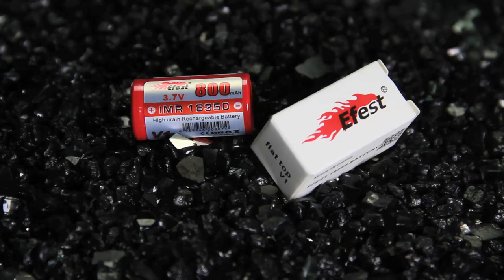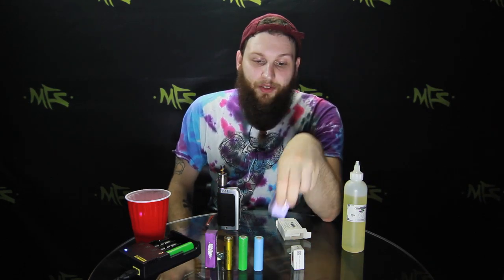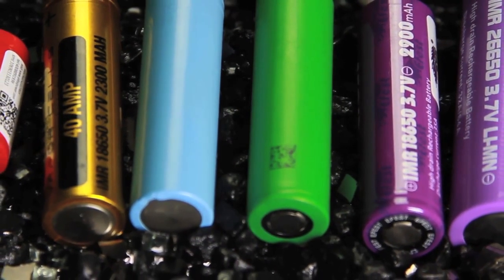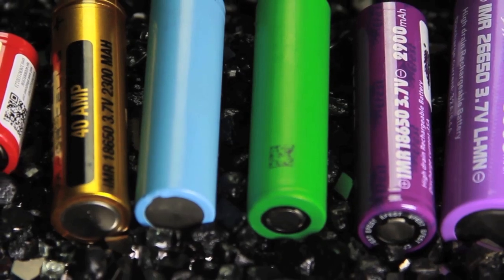With 18350s you can't really build extremely low, especially because the amperage is low — that is pretty dangerous. You don't want to put a 0.03 ohm build on an 18350 mod; that puts an extreme amount of stress on these batteries. I really recommend new people download a battery safety Ohm's Law calculator on your smartphone, or Google an Ohm's Law calculator. Take your battery, get the specs — the amperage, voltage, whether it's high drain, anything like that — type it in, fill in the variables, and you can get the lowest resistance you're able to safely build on that. I don't like to skirt close to that limit.